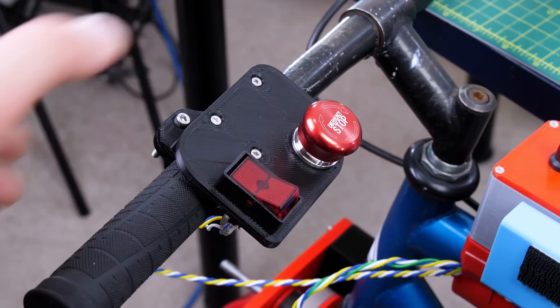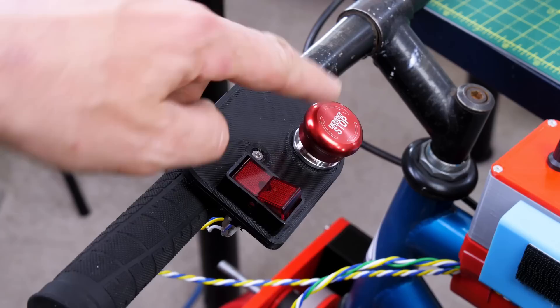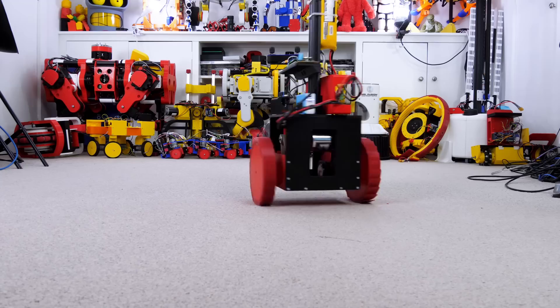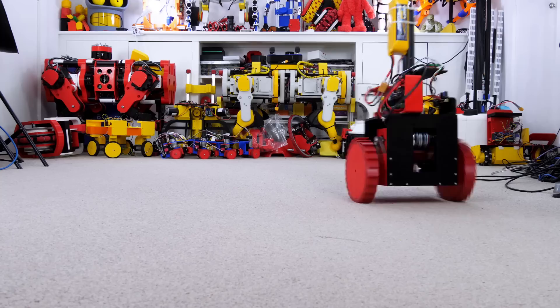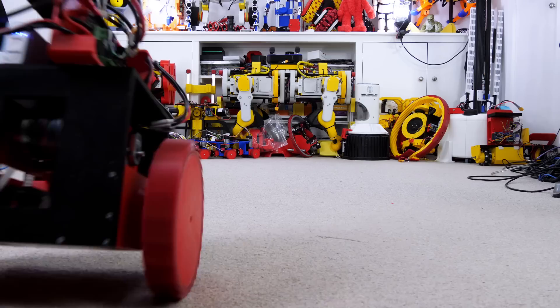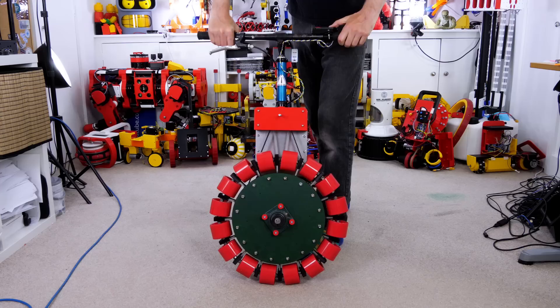On the handlebar I've got a control panel with a switch which is going to switch it in and out of balancing mode, and I've also got an emergency stop button that resets the oDrive and disarms the motor. I've built quite a lot of balancing robots in the past and there's a balancing robots playlist on my channel you can check out. In one of the recent videos I talked quite a lot about position hold algorithms — I'm doing something very similar here with a PID controller that tailors the motor velocity with reference to the amount of lean measured by the inertial measurement unit.